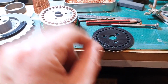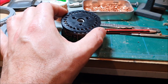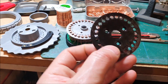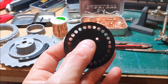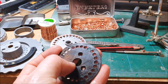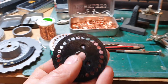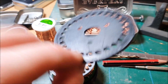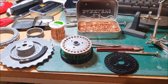The other thing I did is have a go at fitting the top cover on there. I did get it to fit but it took a lot of force. The good thing is when it is in place it holds all the rivets very nicely. But what I need to do is reprint this and probably make these holes 0.1 or 0.2 of a millimeter larger diameter, and then it should just be a little bit easier to get that top cover in place. But I think that's probably enough for tonight.